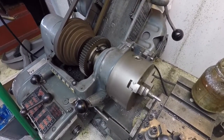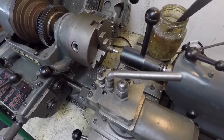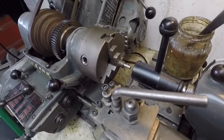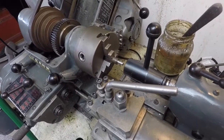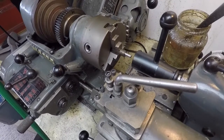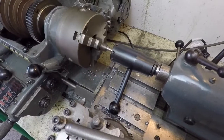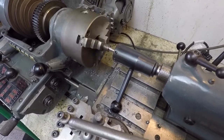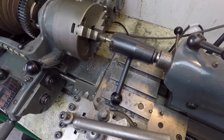That's pretty slow and we can do our thread cutting at that speed. So we can now slide the tailstock die holder up to engage the work — just lock the tailstock there. You need to be a little bit careful with this because you're doing it under power; I would only recommend doing this with very small threads. For large threads you're going to be introducing a lot of forces, so it's probably worth using an alternative method, but for a six millimetre thread this is perfectly acceptable. I've moved the tool post out of the way by drawing the cross slide back. The tommy bar on the die holder is now resting on the lathe's cross slide so that will stop it rotating.